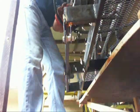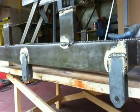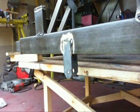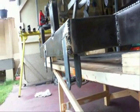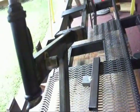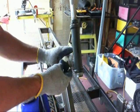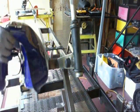I got the front and back suspension supports welded in place and I just have to clean it all up and get it ready for painting. Now I'm installing the supports for the fuel tank — I use three-quarter inch pipe and weld those pieces into position.